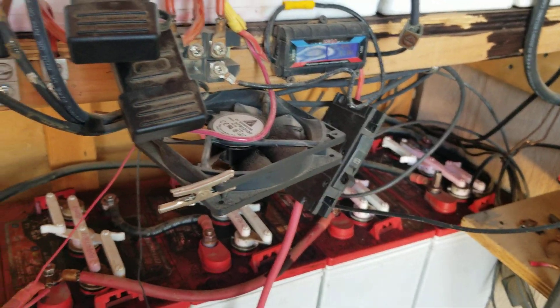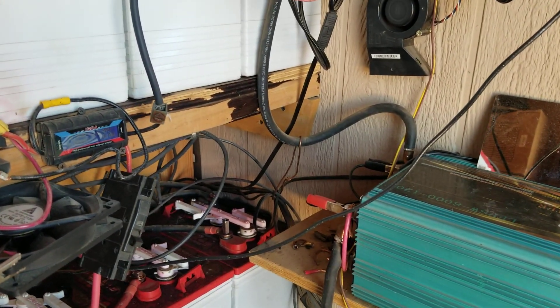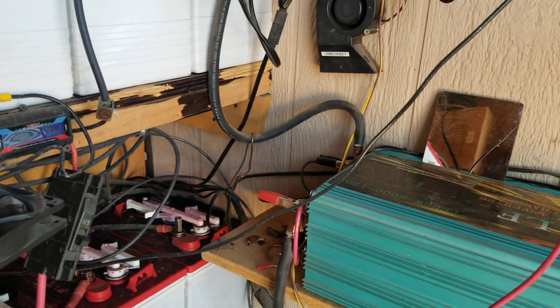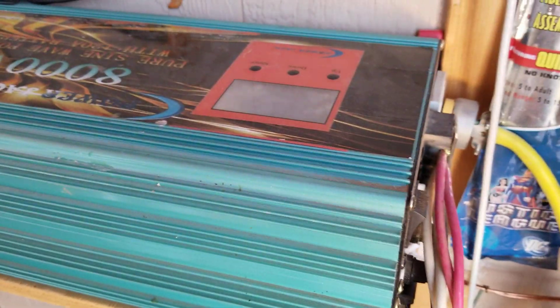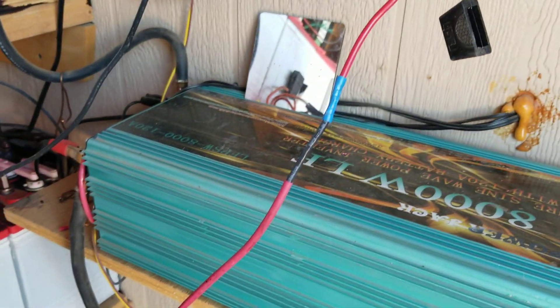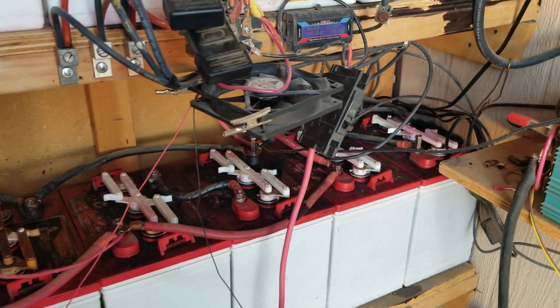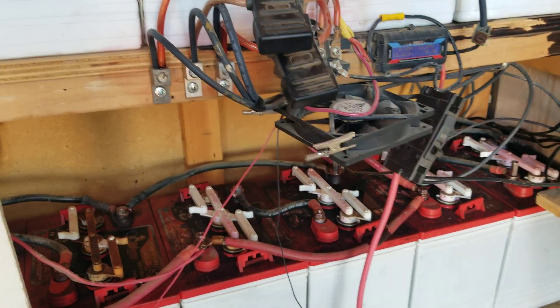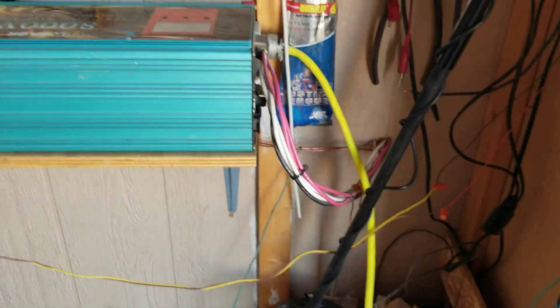That's the correct way to do it. I was short on wire when I did the last setup so I just used what I had, but it was putting too much pressure on the center battery. To do this safely, I went inside, shut all my breakers off at the breaker panel, then came out and shut the inverter off. If you're playing with battery cables and they slip and make an arc, you could blow the electronics and face an expensive repair. It only took 15 minutes.